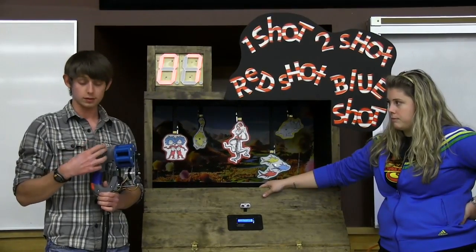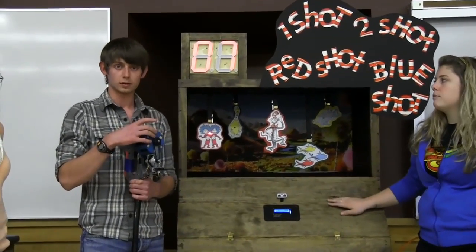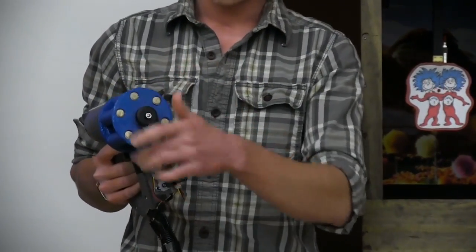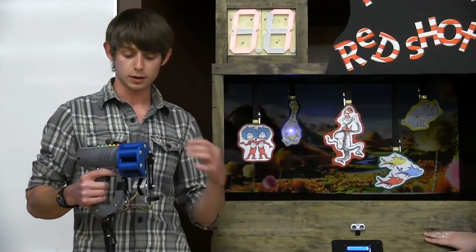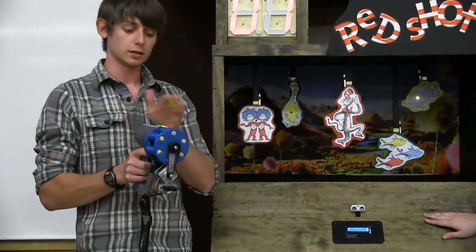What we ended up deciding is having basically a solenoid — it's just a 10-amp coil. It shoots a plunger which hits one of the targets in here. We have a six-round revolver that basically rotates to the next position for each round. When you turn the game on, the barrel rotates until it hits this positioning switch over here, which lines up the first barrel in case you'd moved it around at the beginning.